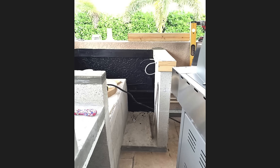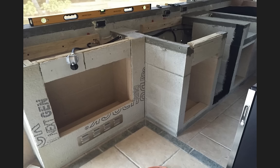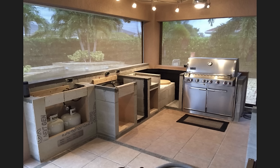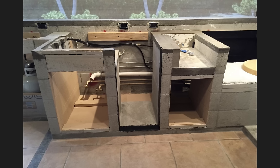I decided to paint black around the edges of everything, because when you open up the garbage can, if you're in the pool or standing far enough out, you can see the wood back there — so by painting it black, you can't see anything. I also painted black around the ice maker so that edge disappears; the white concrete was really noticeable. Here I'm basically ready for granite. I put some backer boards in here and in here to support the back of the granite. I had some extra paint, so I went ahead and painted the insides of the cabinets a cream color — really just for cosmetics.